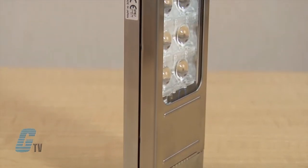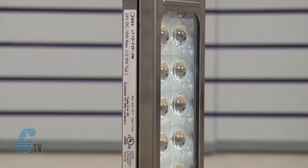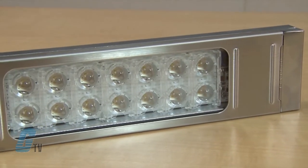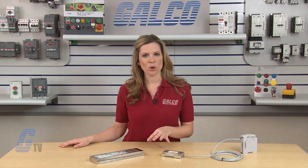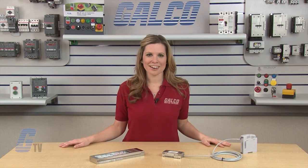The slim and wide versions are available as a single strip of 10 LEDs or 2 strips of 7 LEDs. They both can come in standard or high luminance models. The standard models are capable of an illumination up to 1,100 lux and total luminous flux of up to 840 lumens. The high luminance models are capable of an illumination up to 1,450 lux and total luminous flux of up to 1,260 lumens. Both models have power consumption up to 12.5 watts.